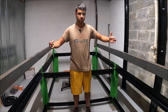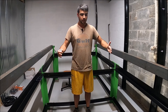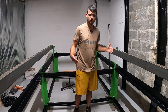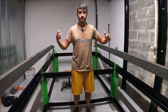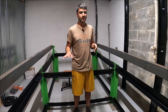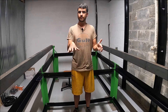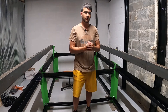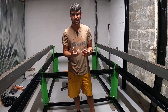That should at least make sure the two rails are in plane. Then once they're in plane, when I hook up my router attachment, I should be able to bolt or clamp some sacrificial material to the router bed and plane it with the head of the router. Then I'll know I have a plane in the machine coordinate system to put my material on.